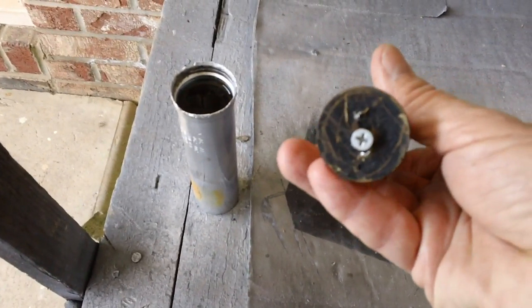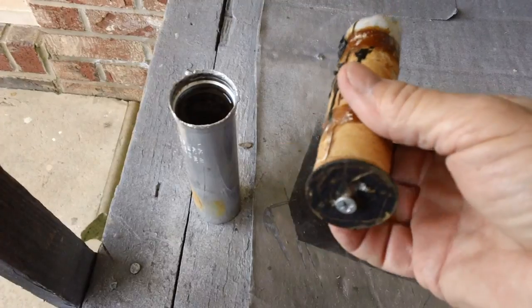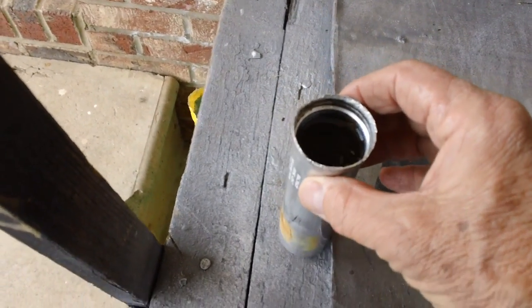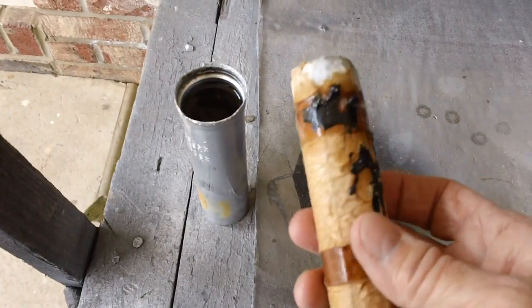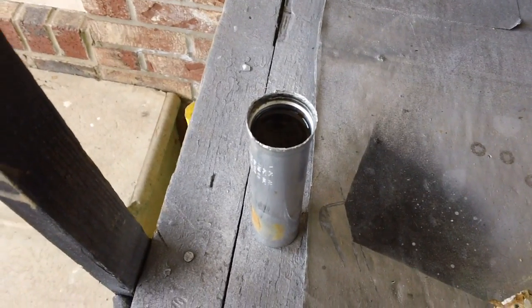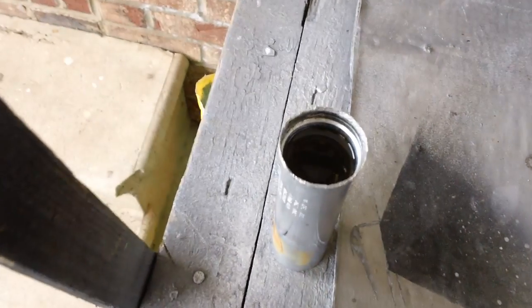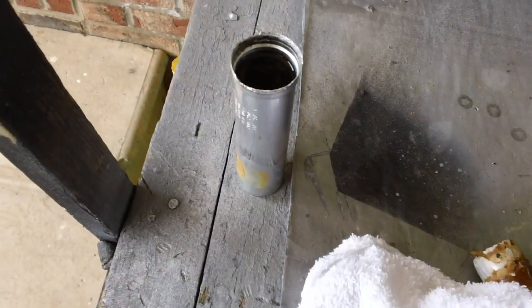She came right out once it got hot enough - the old vice grips on that screw just pulled it right out. Remember, if you plan to use a screw instead of a corkscrew, you've got to have really coarse threads - real fine threads probably wouldn't hold as well. Right now what I did was fill this thing up with lacquer thinner and I'm going to let that sit and soak for a while to clean it out. After it's soaked for half an hour to an hour, I'll take a toothbrush and scrub it clean. I'll cover it with this little cloth right here to keep it from evaporating.